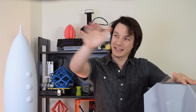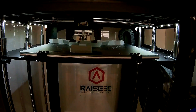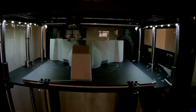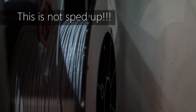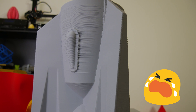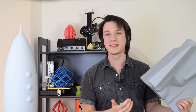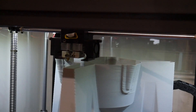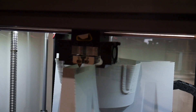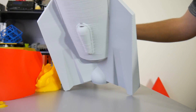My final test was to take the rocket and try to turn it into a huge pot for plants, and this was the result. This took five hours — not very long at all — and it was printing fast. You can see in the footage how quickly the machine is sucking down filament; it's absolutely insane. But sadly, this print is, to be honest, terrible quality compared to what I was getting out of the smaller prints. I think it's to do with slicers not being designed to work with nozzles this size, and also it's quite flimsy at the top. Every time it changed direction, it would cause filament to raise up and catch, so although it started nicely, it got really rough towards the top.